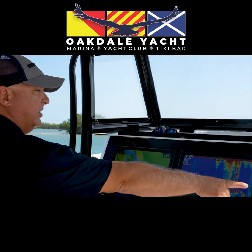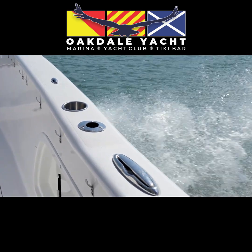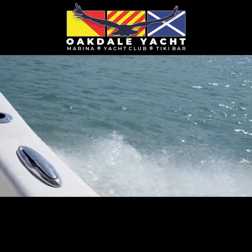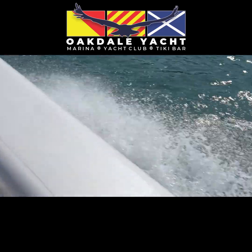Here's the perfect example of not having enough trim in the boat. You'll see that the water is breaking forward of the console. When you trim this boat properly, you'll see that that spray should be all the way back by the leaning post.